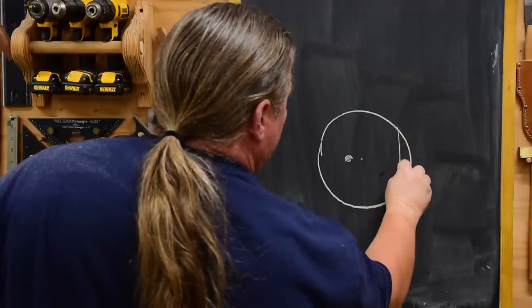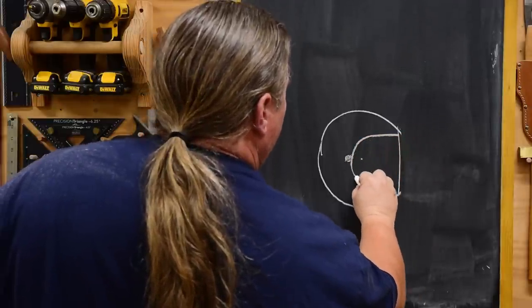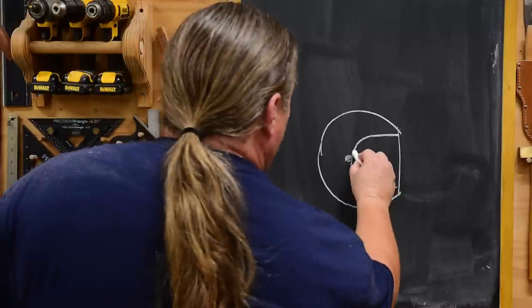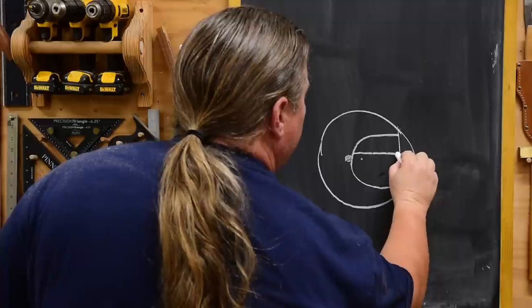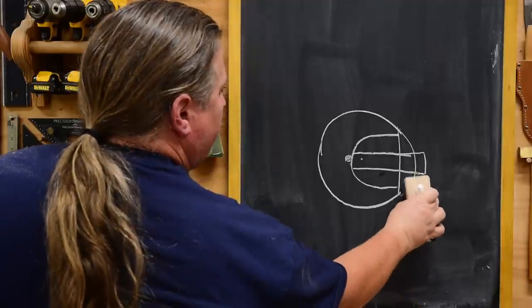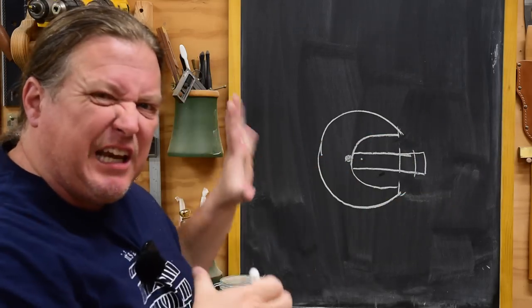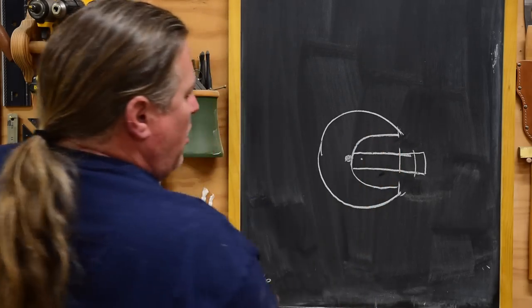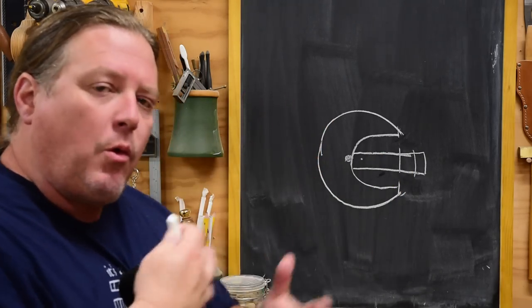How we do that is we eliminate material — we cut off a little bit and hollow it out a certain amount. But we have a problem: we have to have a handle to spin it. So we have material that not only comes to the outside of that circle, but needs to go beyond it a little bit. So while we've removed material through here to reduce weight on one side, we've added weight farther out. If you understand leverage, that weight counts more toward the center of gravity, so you may need to hollow a bit more — but you can't hollow too much because you still need mass on the other side.